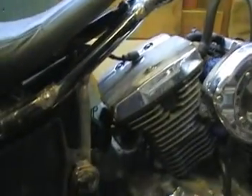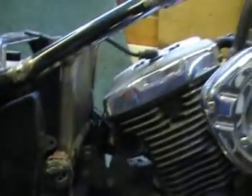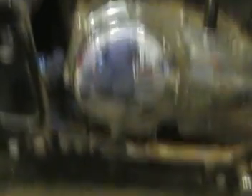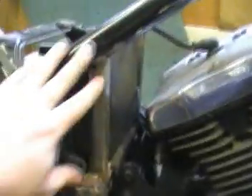Then obviously I've got this to contend with — this can be a plate basically from here straight across just to cover it. My battery box — I can fabricate, put a piece of steel straight across there, and that could be the front face of the battery box, and that will strengthen this whole section up. Obviously I could then put a plate in underneath there as well. The only trouble is the rain would sit on this side, so I'd put in drain holes. I need to get on with it, so I'm going to start stripping it down, get the frame done, then get the engine done. The engine can go back into the frame and then any slight welding alterations I need to make afterwards — after I've strengthened all this up — I could just grind down, weld, and repaint, like to pick up a lug there for instance.